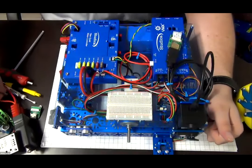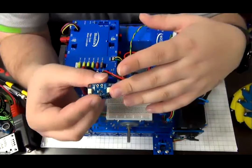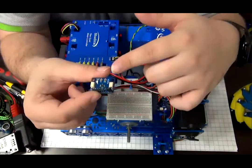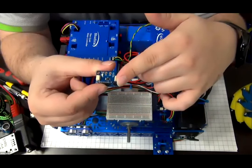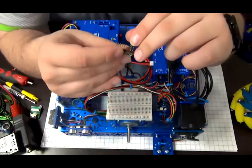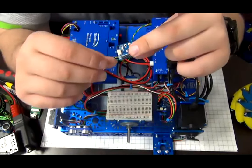The analog module, if you look at it, is very simple. You have the header here, and then there's a jumper here that is for the pull-up resistors on the I2C bus. We have it pre-installed. If it's not communicating, you can take the jumper off, which will turn off the pull-ups. However, that's not required, as from our testing, we found that it's fine.